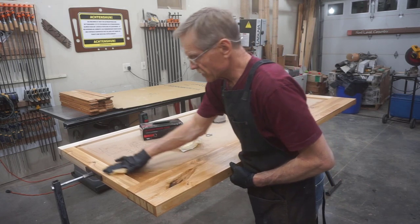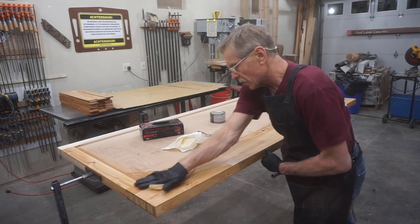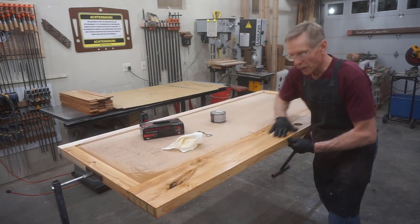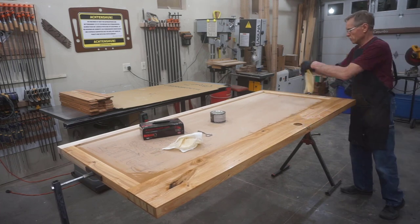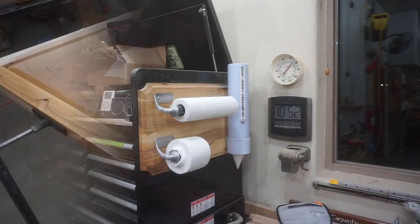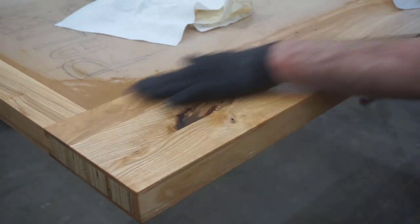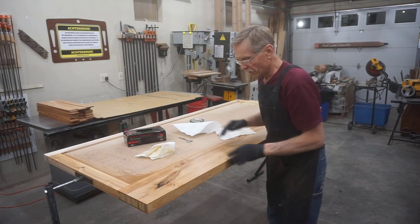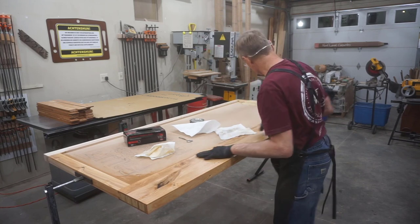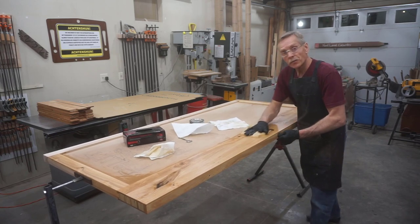Once I'm done with that initial buff down, I'll take the soaked cloth and give the main surface another coat — just a thin coat, whatever's on that paper towel — but I'm not globbing it up in the corners or any of the holes this time. Just kind of adding another layer helps build the sheen a little faster. Then I grab a fresh paper towel and do a second final buff on this first coat of gel poly. If the gel poly kind of gets away from you where it starts getting too sticky to wipe, you can always take that saturated cloth, wipe it back on there — you'll feel it wake that finish right back up.